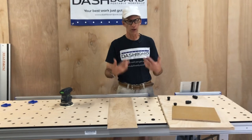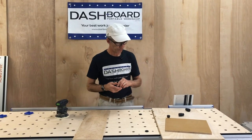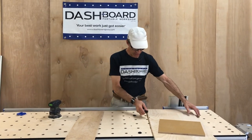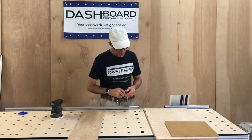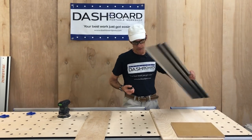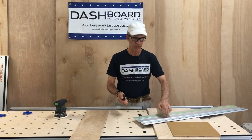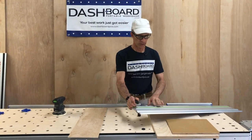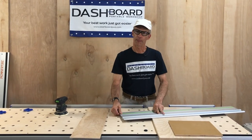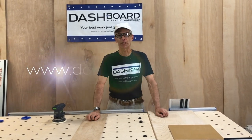No matter how you're going to use this, I hope that explains what it's all about. The other thing is, if you're performing some impromptu cutting process with your track saw on, let's say, 3/4 or 18 millimeter material, you don't want your guide rail to get hung up on a tall dog and not be able to hit the surface of the material. So you would choose a thinner one so the guide rail passes right over it. That's about the most there is to explain — thanks for watching.